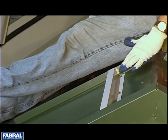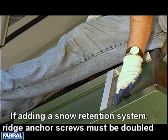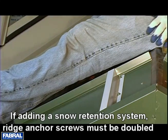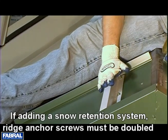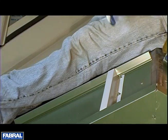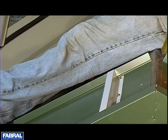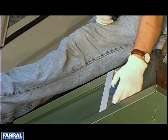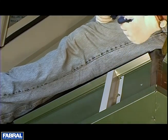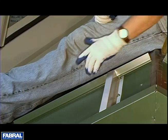The way you want to anchor this down, you want to put butyl sealant tape under this flange with three fasteners. You can always bring a piece of ridge cap up, establish where you want this, string a line or pop a line so you get them all nice and straight. Then get some gun grade urethane sealant — like a caulk — to caulk the sides of this Z-closure, and then put butyl sealant tape on top. That way the bottom, top, and sides will be weather tight.